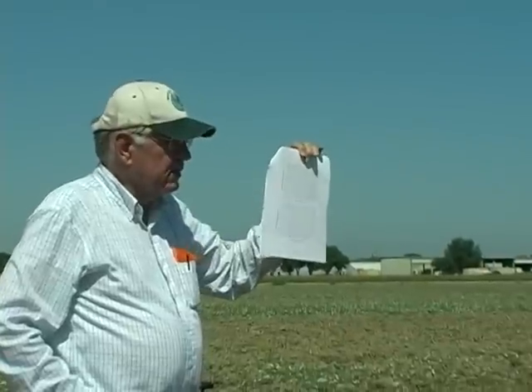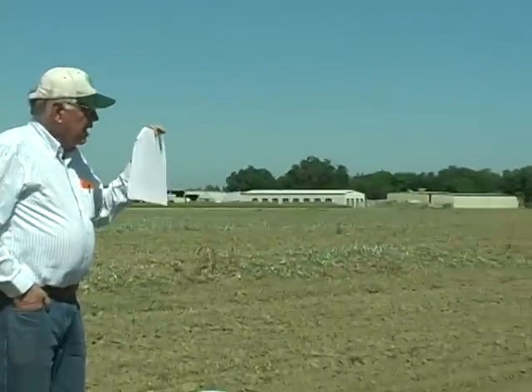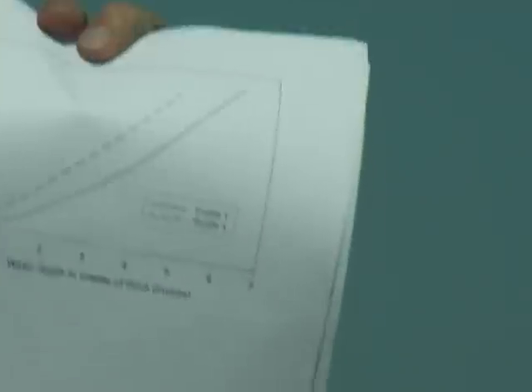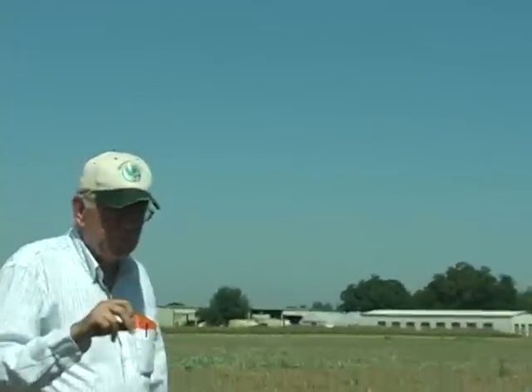That's the old-fashioned way. If you have some graphics programs, you put the coordinates in on different parts of the profile and they will calculate the area for you. Before you do any measurements, you've got to go out to the site and get this profile. Then on the next page you plot the depth of water in the deepest part of the ditch versus the cross-sectional area, and this data is entered into the computer. They have generic cross-sectional shapes — trapezoidal, U-shaped, ellipse — but I tried using theirs versus the actual cross-sectional area and there was considerable error.